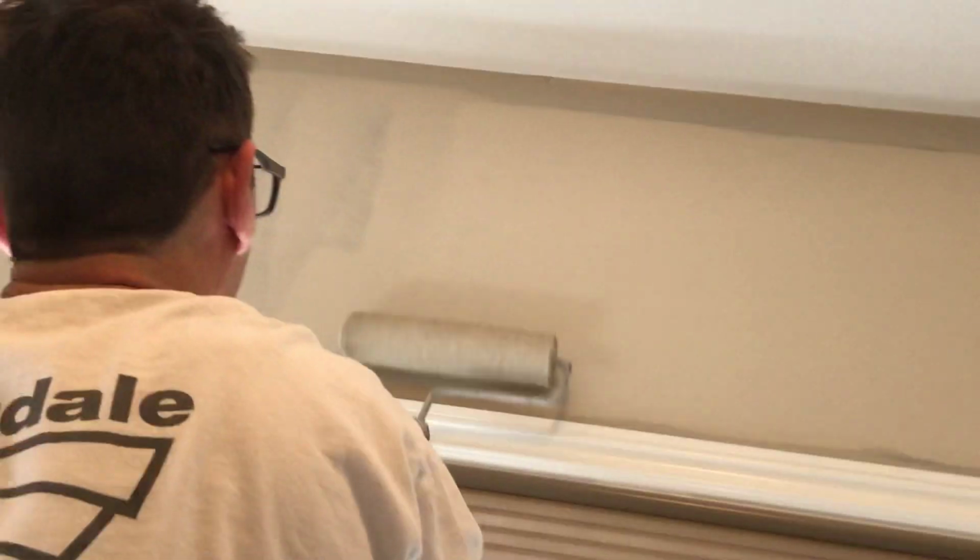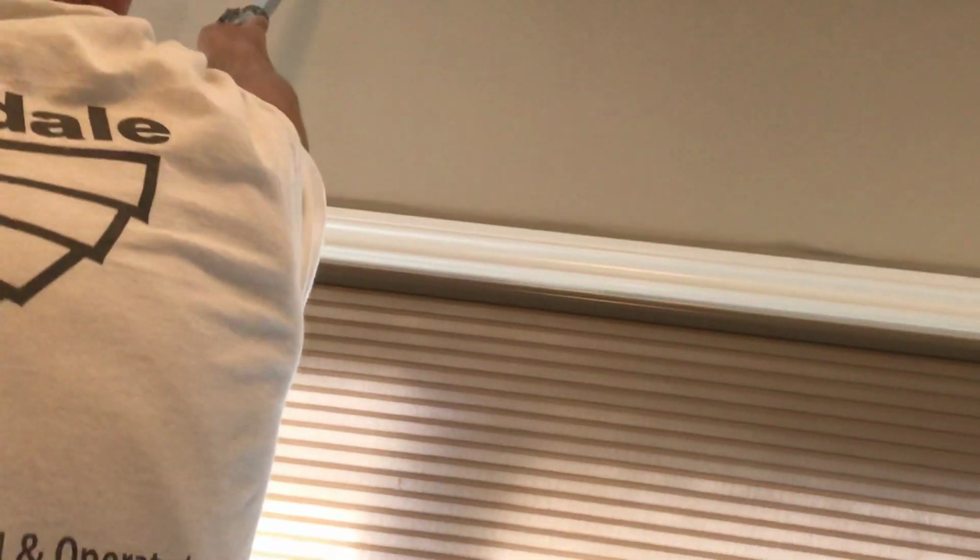So, back here, now we can just spread it out this way. Now when you're rolling out a wall and you do something like this, don't leave it, okay? And go for lunch or go on a break. Because then you'll be sorry. Smooth it out. I've seen it happen before. People have done it. Then you have to take a palm sander with 80 grit sanding paper to that.